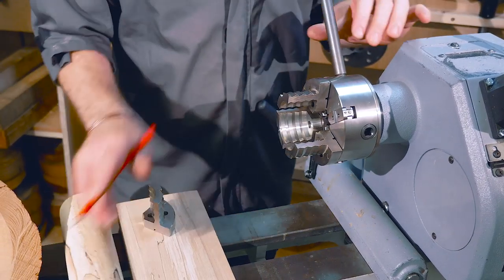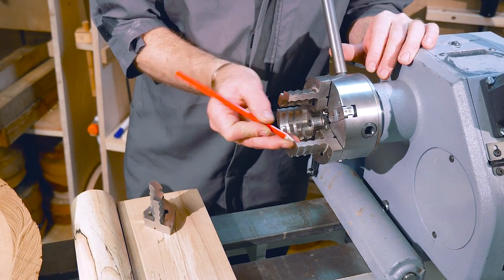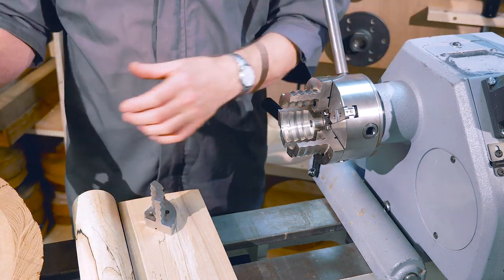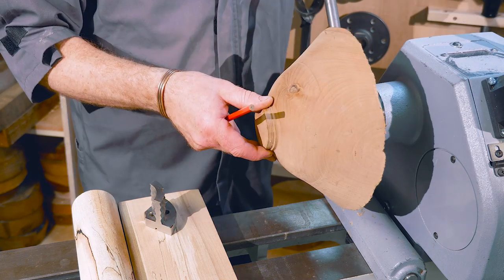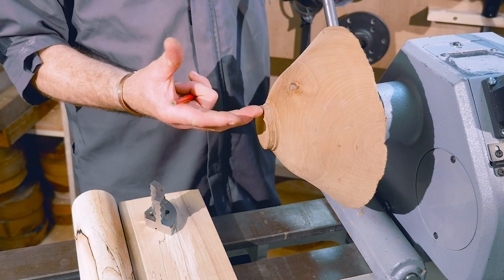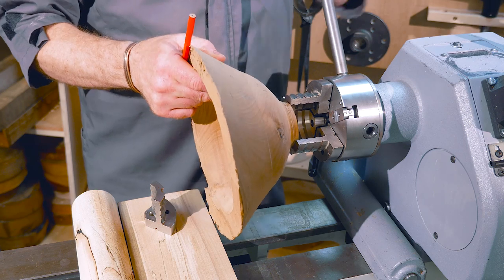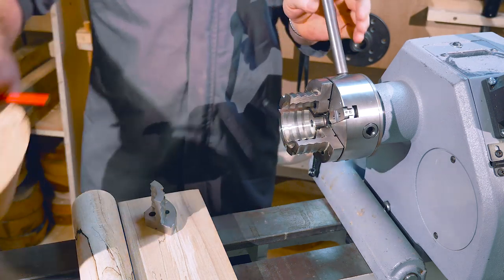On the top and bottom we have a dovetail on the outside and one on the inside — lots of depth and lots of strength on here. Another thing I use these for is my rough-turned bowl — we can put that into there, tighten that down and grip it to allow us to get back onto the outside, clean that shape up and true it up. Then obviously we can reverse it and re-grip on the foot. Very versatile for that sort of scenario.